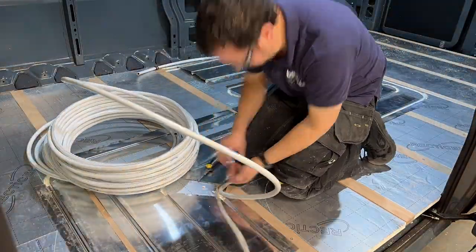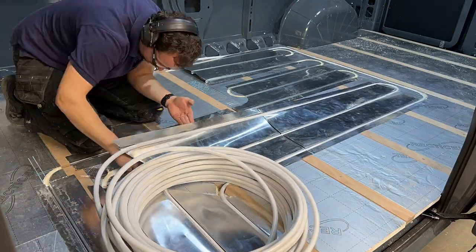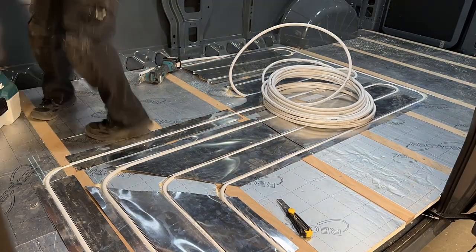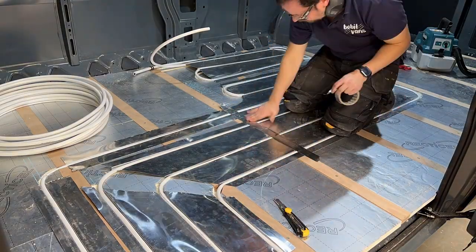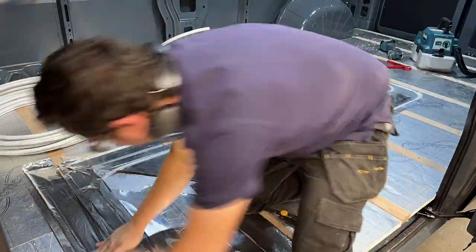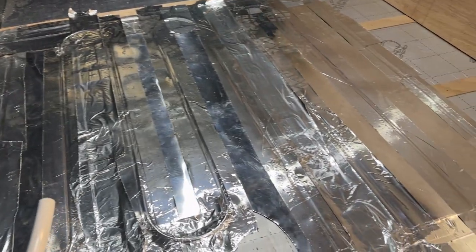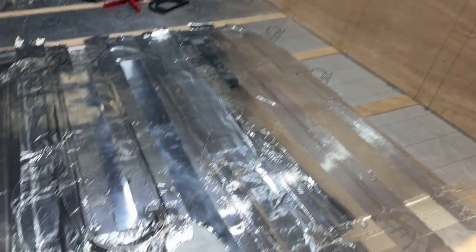When you're putting the pipes under the floor, just make sure you get a nice smooth bend. You'll notice with this pipe it doesn't have a memory like some other underfloor heating pipes, so it doesn't tend to spring back — which is a real advantage when it comes to fitting. I did have to multi-tool the insulation a little bit wider in a couple of places. If you want to make your life easier, you can cut the channels at more like 20 mm and that will mean you don't need to adjust them. Just make sure there are no kinks when you do the bends and you've got a nice smooth flow. After the pipe's down, we start to put the foil tape on — this is just to conduct the heat from the pipe onto the spreader plates to get a bit more heat conduction. I've also added a sensor taped to the underside of the spreader plate, sitting in the Celotex. That tells us the temperature of the floor and that's what we'll use as feedback to moderate the floor temperature. Next step is to put the ply down, get that screwed down, and then we can start attaching this to the rest of the heating system.